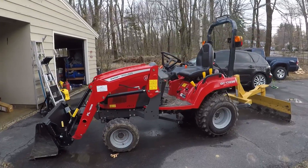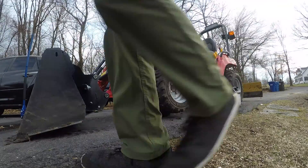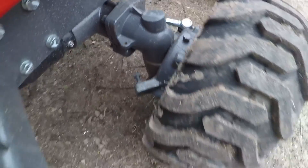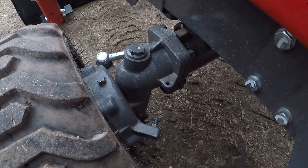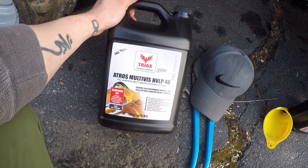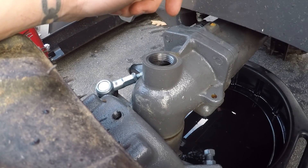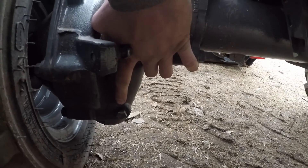If possible, park your tractor on level ground. Depending on how large your drain pan is, you may need to raise the front of your tractor. If you have a loader, you can use it to pick up the front of the tractor. Before you start draining the axle, notice that both sides are not identical. They both have a drain plug and a breather plug, but there is only one fill plug located on the left side. I did not realize this at first and it caused me to waste a bit of oil. Work on one side at a time. Remove the fill plug to allow for better drainage. Remove the drain plug and allow one side to fully drain, then move on to the other side. Once both sides are drained, ensure that both drain plugs have been replaced and are tight.